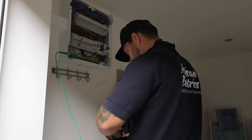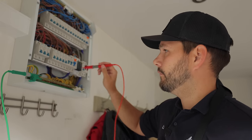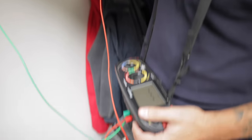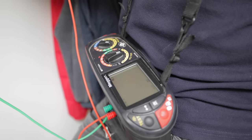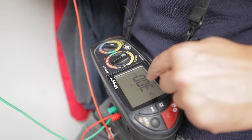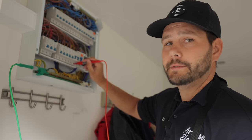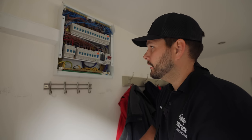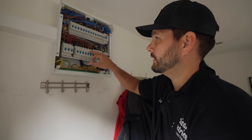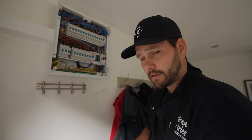Failed - classic. We're just going to do tests on the RCD, just working on this bottom row. I've put it to auto at 30 milliamps. At half times it's fine, it passes. But at one times - 300ms - it's failed. That basically means that RCD has failed and it's not working properly. Some RCDs don't actually like you testing them, so there's another way. If we go to any sockets on this RCD and actually plug in and do an RCD test from there, that might actually make it trip. So we'll go and do that now.